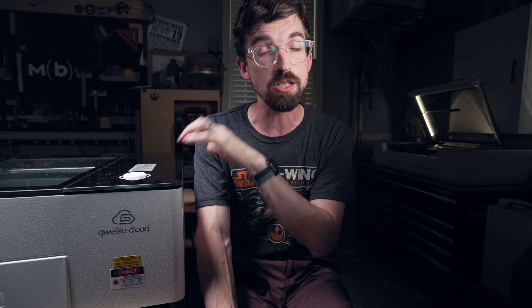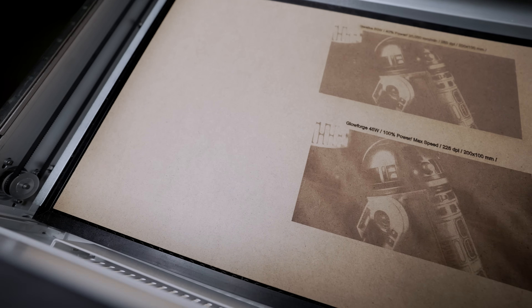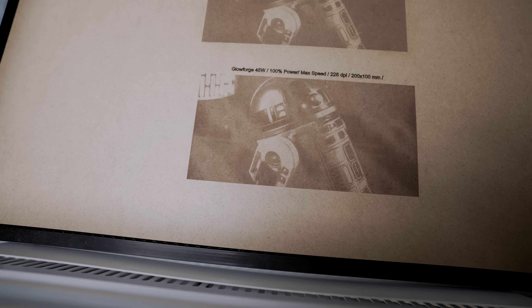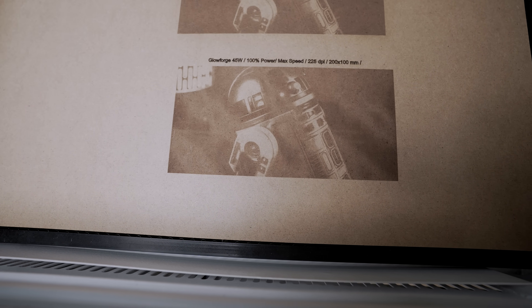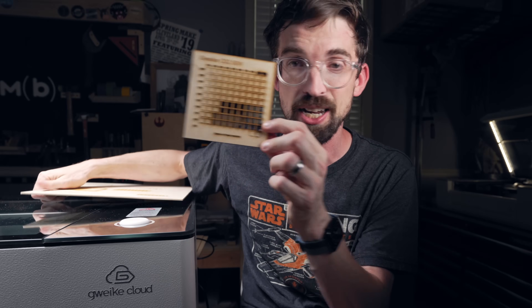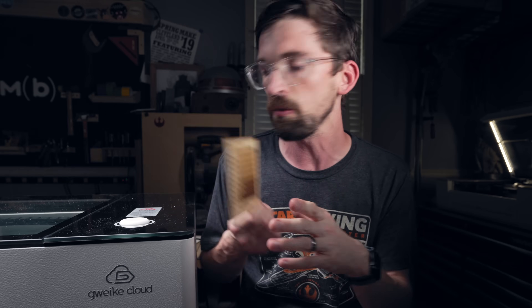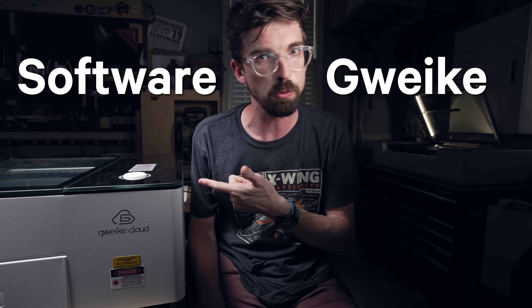The big positive for the G machine is that you can control it with Lightburn, which is my favorite software for controlling all of my machines. Pretty much everything in my shop other than the Glowforge runs through Lightburn, which is incredible. Because of that, you can really tweak settings — like the acceleration we talked about earlier — and fine-tune everything to your situation. Lightburn also lets me run test files for both cutting and engraving. These are updated versions of the test files I've used for my diode lasers, adjusted for this faster and more powerful machine. There's a link in the description to download them. Based solely on the fact that this supports Lightburn, the software winner is the G machine.